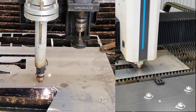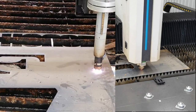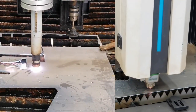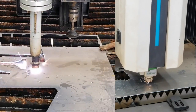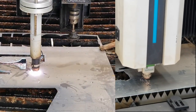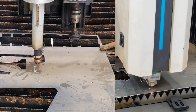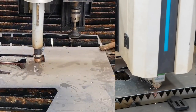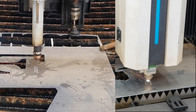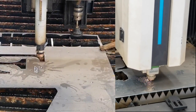I'm going to do a quick voiceover while these are cutting. I wanted to point out that the lift height on both the laser and the plasma is set to two inches. On the short moves between each hole, the main difference is that the laser retracts and rapids simultaneously, where the plasma does its full retract and, when that's complete, rapids and then plunges to pierce the next hole. Both are cutting at the same speed, but the acceleration and the combination of rapiding and retracting at the same time really makes the difference. The laser completed this in four minutes and the plasma took roughly 14 minutes.